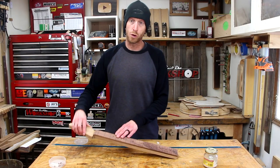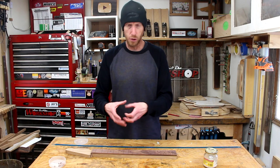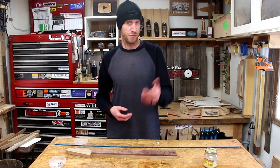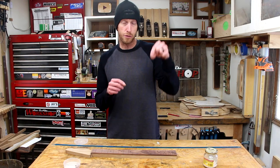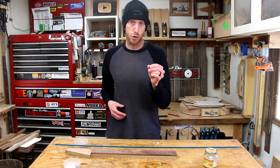Now to fill these fretboard marker holes, there's about a bazillion different things you could do: glue in some dowels, some little mother of pearl dots, or any number of other things. I'm gonna do something a little bit different and something I've kind of been having some fun with lately. I've got some teeny tiny pieces of copper tubing that I'm gonna glue into the fretboard marker, and then we're gonna fill that center of the tube using some crushed seashells.